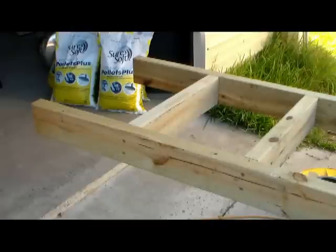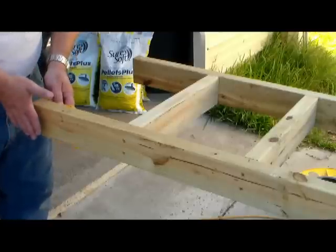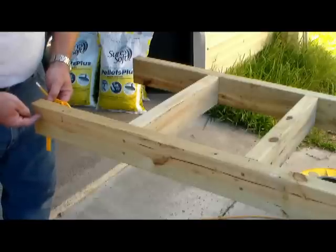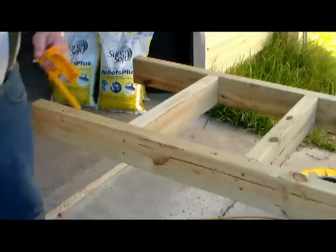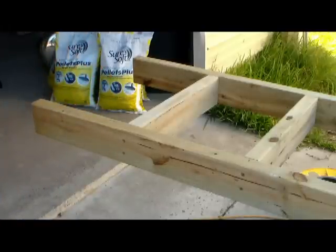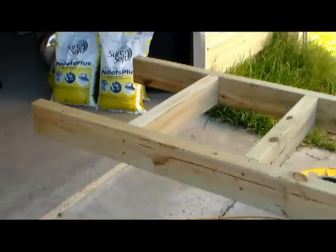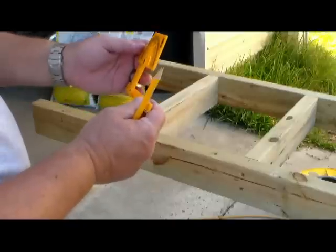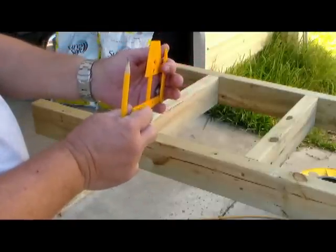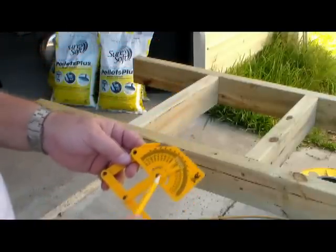Alright, so we're ready to cut the angle for the base of the ladder since it's going to be permanent. If it wasn't, what you want to do is get a piece of metal that you bend into a U shape, then run a bolt through it and don't tighten it all the way so it'll hinge — that'll provide feet for you. For our purposes, we're going to lean it against the blind, so you're going to use a tool like this. You put the tool against the portable ladder that I have up there right now, then you measure against the face of the place where it's leaning and the ladder itself and match the angles. This will tell you how many degrees you need to cut it.